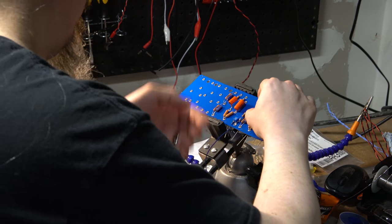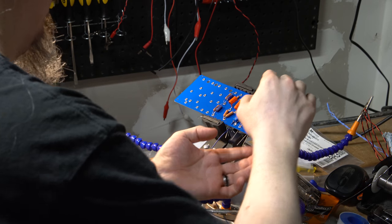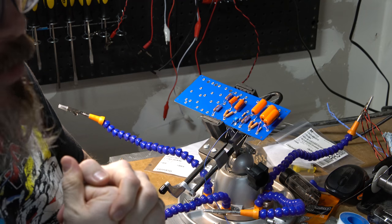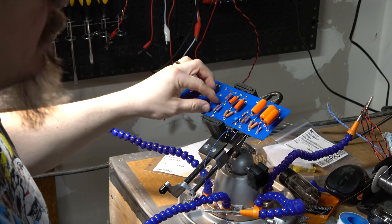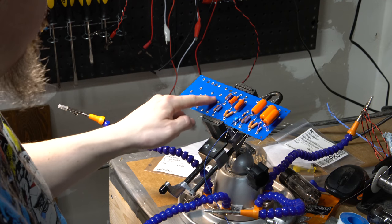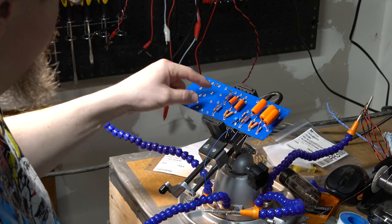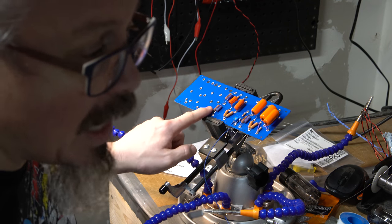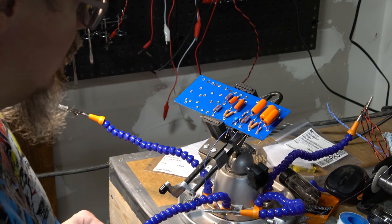Perfect. And we're in business there. Okay. So next, we're gonna have to miss this guy short term till I can order one of those. But we do have a series of three resistors here that will go underneath the other capacitors that will go above it, so I'm gonna get those in. We have a 1 meg on either side and then an 820 ohm in the middle.